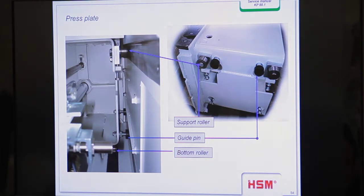And when the press ram is moving, here we have a fixed contact point with a dowel pin. So the cylinder is fixed in the press ram. When the press ram moves, the cylinder also moves. And all the pressure goes on the cylinder piston head inside. And then we damage the seal, or we damage also the cylinder tube. And then it's not necessary to change the seals, because we also have a damaged tube, and then we can replace a complete cylinder.